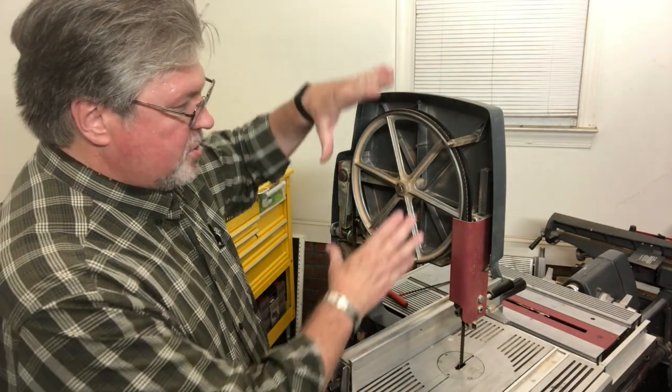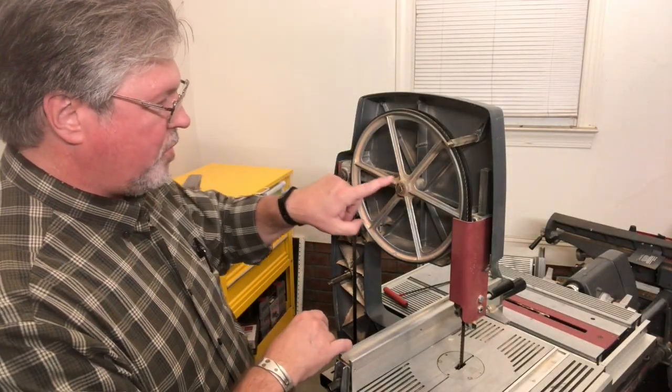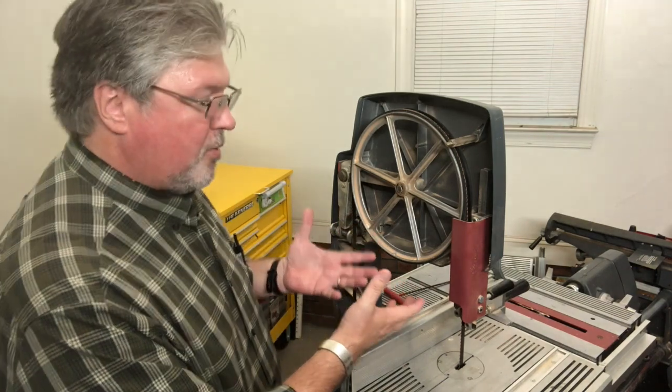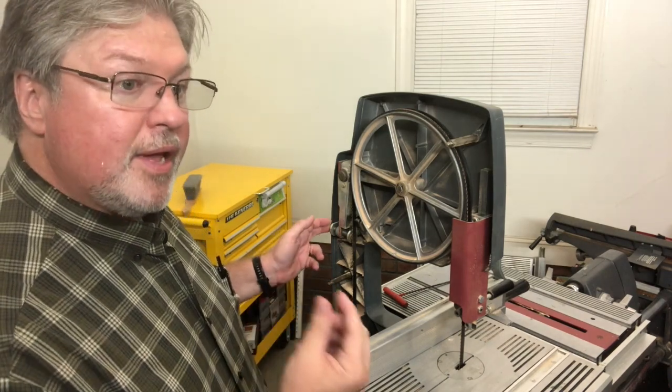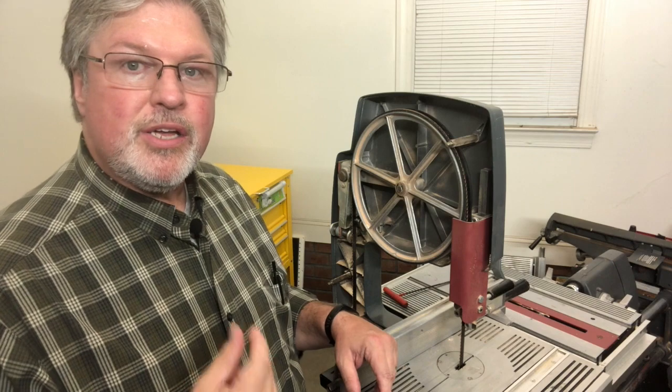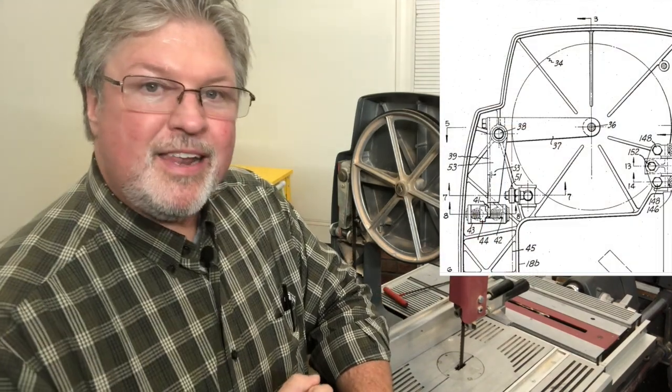The tensioning is unique as well. Instead of having a big knob and a plate moving the upper shaft, the arm here supports the upper wheel. Here's the next interesting feature of the patent: when the engineers were testing this, they discovered that tensioning the blade by raising the wheel — tightening a bolt right here — was putting too much tension against the bearings on wide blades. The blade was running too hard against the bearings, so they engineered some flex into this arm.